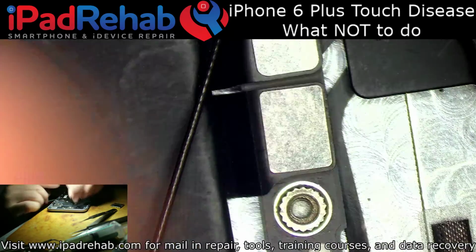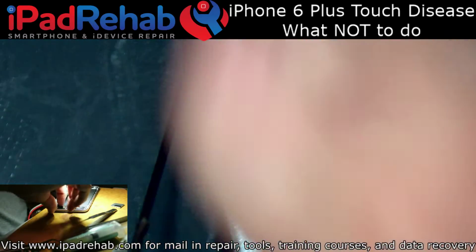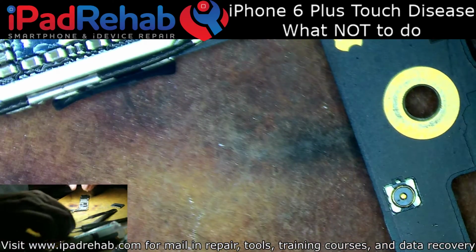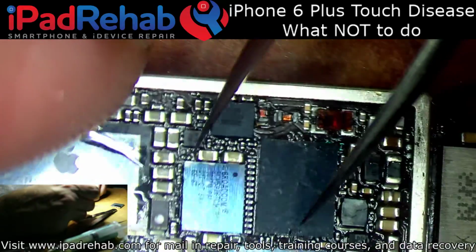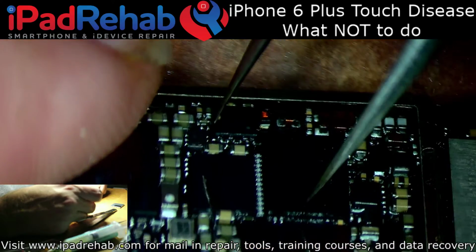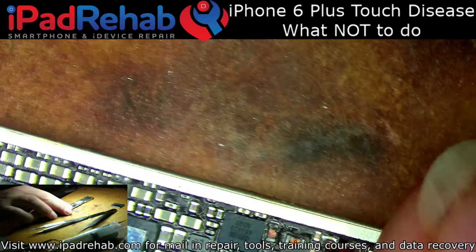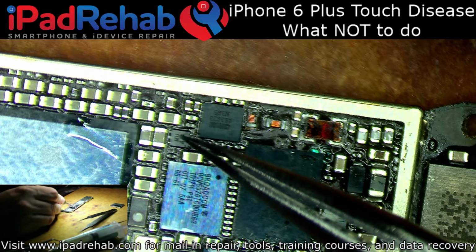So one thing that I have seen cause touch problems a few times is if this little 6-pin guy, who is a buffer for, I think, an enable line that has to do with the proximity sensor and ties it into touch. But this little guy right here, I've seen him go bad before. And sometimes replacing him can fix it. So I'm going to go grab my donor board and we'll come back and we'll change out this guy right here.